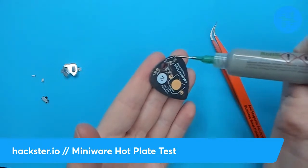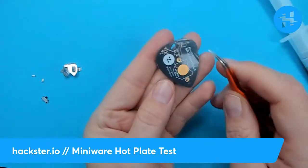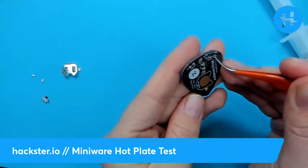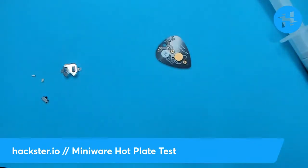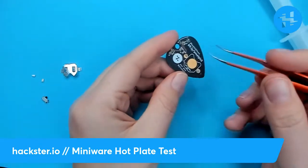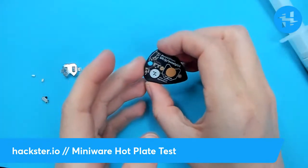Onto this, I'm going to start dispensing the solder paste here. It's got to fill up this little nozzle first. I probably won't be very precise because I don't do this a lot. This is my first time using the Adafruit supplied Miniware mini hotplate preheater. I haven't done a lot of surface mount stuff with a hotplate in the past, because that desktop hotplate was very unwieldy — annoying to set up and takes up a lot of space. Those two should not be connected — they are bridged. Usually what will happen when you do this is that the solder paste will shrink onto the solder pads, so you don't have to be incredibly precise. But I'm going to separate these two just because. I'm going to wipe that off, and it should just suck itself back onto the solder pads once we heat it up.